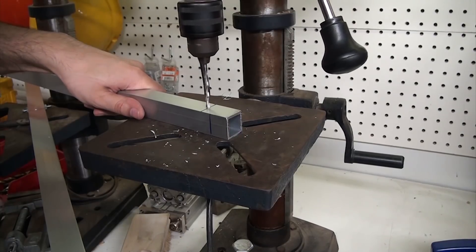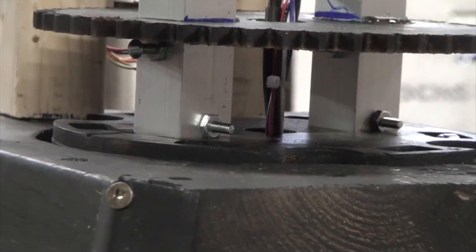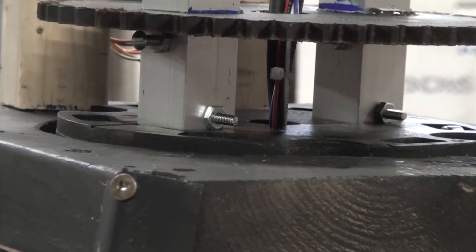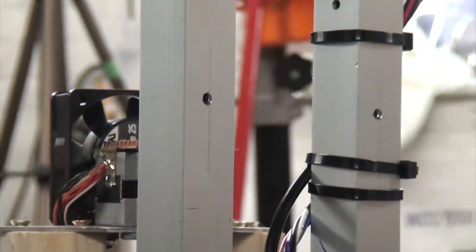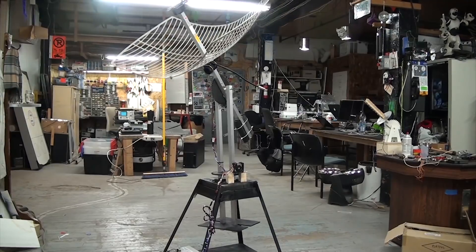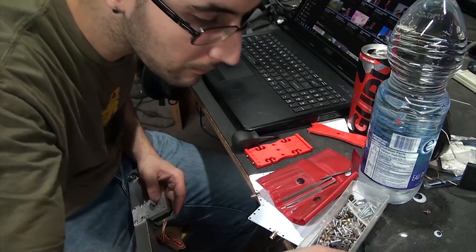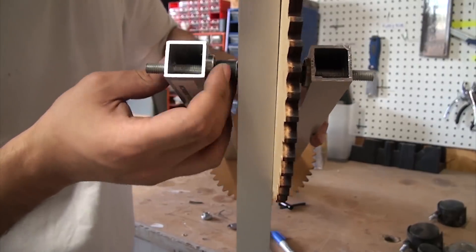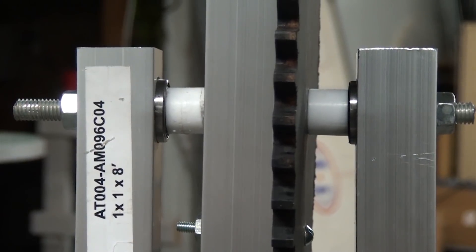The last step is to add ten bolt holes to the vertical supports. Working our way from bottom to top: the first pair is for bolts that will hold the lower weight from falling off; the next set is to rest on the bearing assembly so that the vertical supports don't slide; and the next is to set where the azimuth gear sits. I actually ended up re-drilling these four because once everything was built we were having some unexpected collision issues due to a last-minute design change, so they were re-drilled lower on the vertical supports to raise the upper assembly and stop the collisions. The last four holes were for mounting the now-finished stepper motor mount. One final change is that we subbed out the steel tubing we were using as spacers to hold the armature in the center for some teflon tubing instead. This decreased the friction a lot and really helped things move better, especially once everything was bolted together.